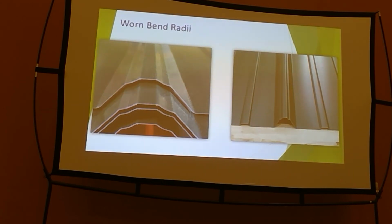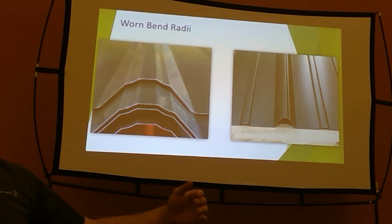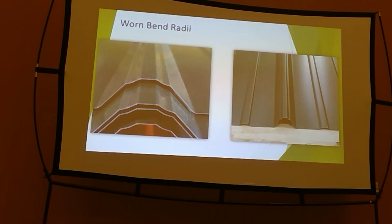A lot of times what ends up happening in this scenario, when your panel starts to get really washed out, as we call it, you start working harder and harder, you're wearing harder on the tooling, you can't get any more out of your overform, you start hitting it earlier in the mill, start to wear that out. When you start to see this washed out panel and you are already down on your overforms, you're down late in the mill, call up your manufacturer and ask them about a recut and fix your overform tooling before you wear out the rest of that roll form.